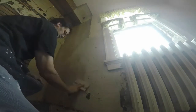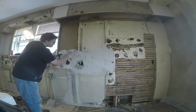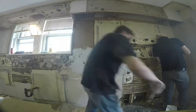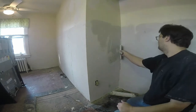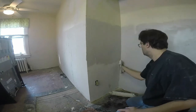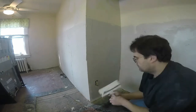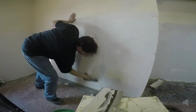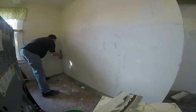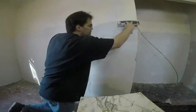On this wall, on the right-hand side, someone has chopped some of the plaster. Some of the people I work with prefer to do that — chuck parts of the plaster out and put their patches in. I do not like doing that. I think it makes too much dust and takes too much time. They will admit that I am ten times faster at patching the wall than they are when they're chopping little squares and putting a drywall patch in. That said, when they do that and I run skim coat on it, it is easier to skim coat and you might get a slightly better product when done, so it has its benefits.